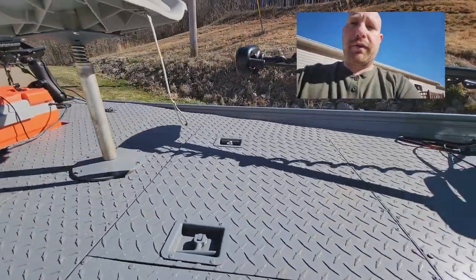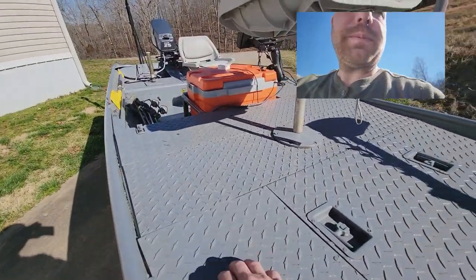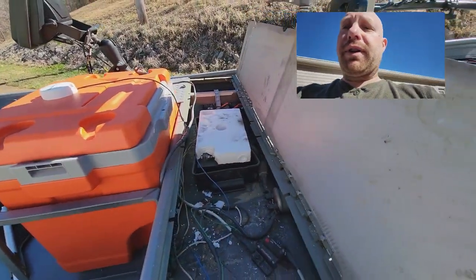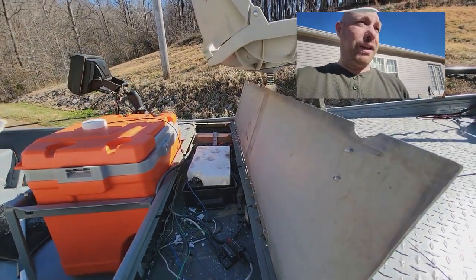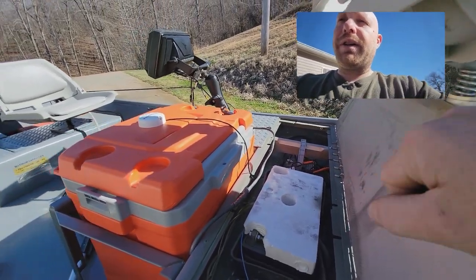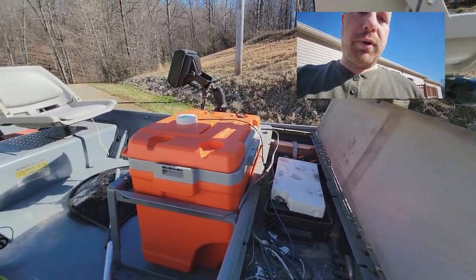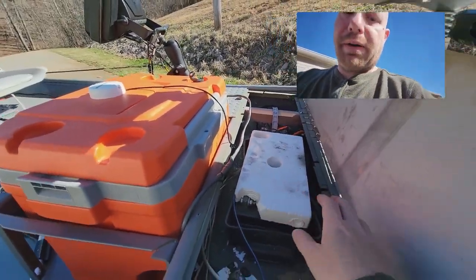I have a front seat up there. There is foam running all underneath this part of the deck here, and around the box over here there is foam. I have the battery compartment right here with two batteries and a fuse rated for the trolling motor. I have a standalone smaller battery for the Helix unit, and I have the lights, the trolling motor, and the bilge pump wired off of the main battery and a breaker.